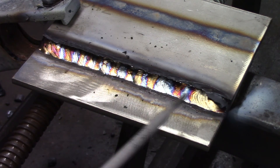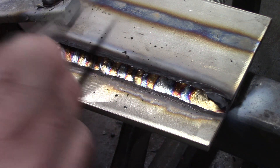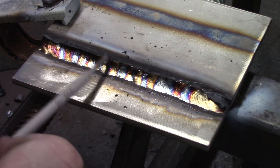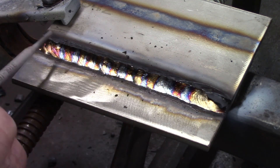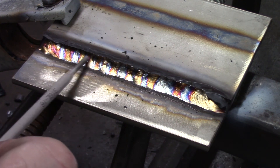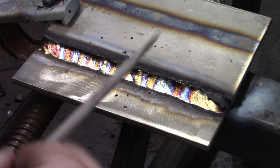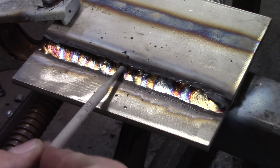Here is our second bead. I think I was happier with the first bead. The first bead on the other side pulled the two plates apart ever so slightly, which gave a little more gap. So I have quite a bit of underfill and a little bit of undercut just about all the way down. I should have dwelled just a little bit longer, taken it a little slower and filled this up more. But with more practice it would be a lot better. I absolutely love the color though — you've got to have feel and no undercut.